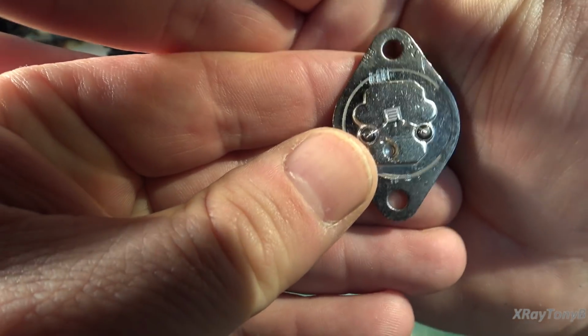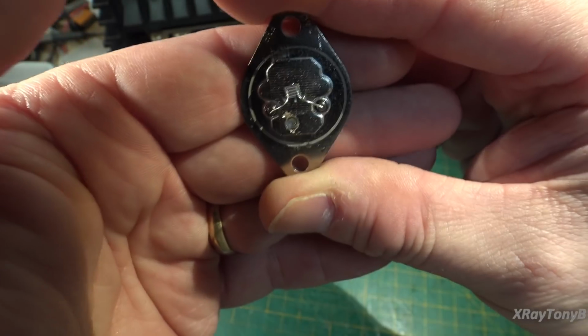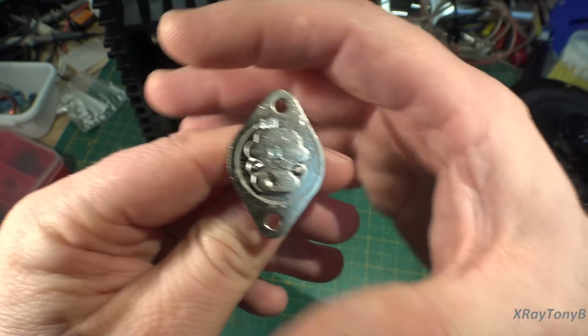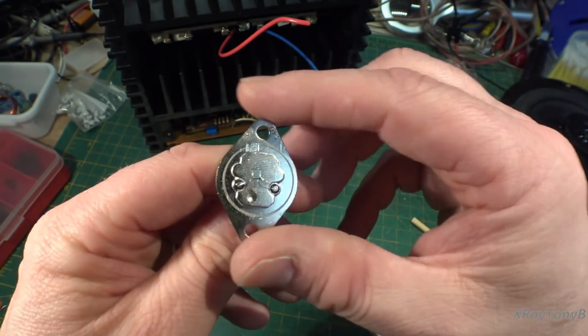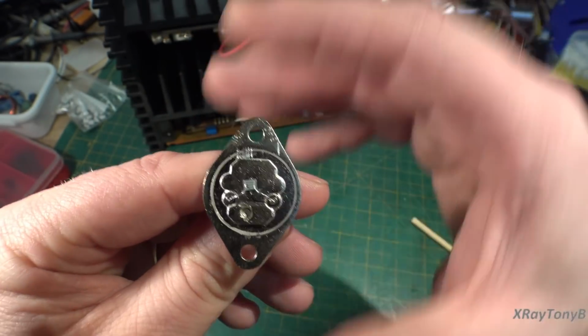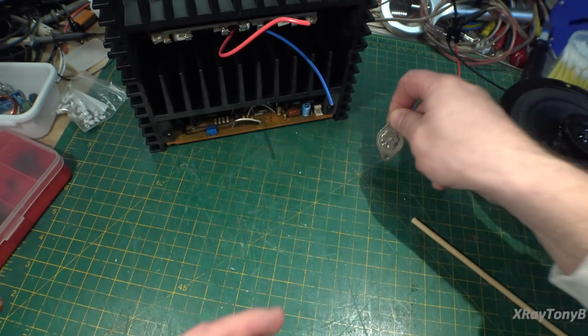And because of that, that causes capacitance, a capacitive component in there. And right there is what causes the problem. That capacitance actually creates a delay in this thing turning on and turning off and changing voltage levels very rapidly. So that's a limiting factor.